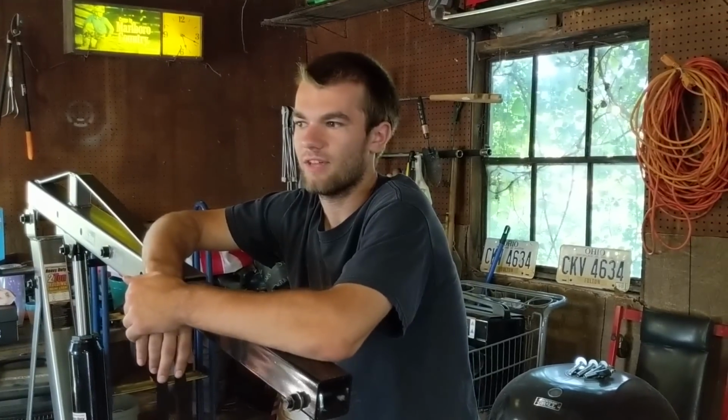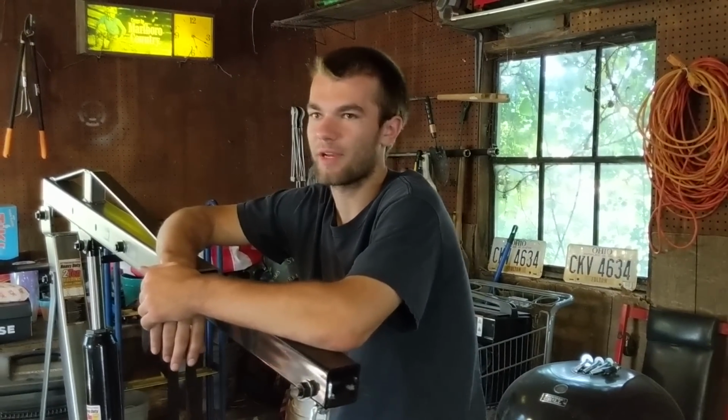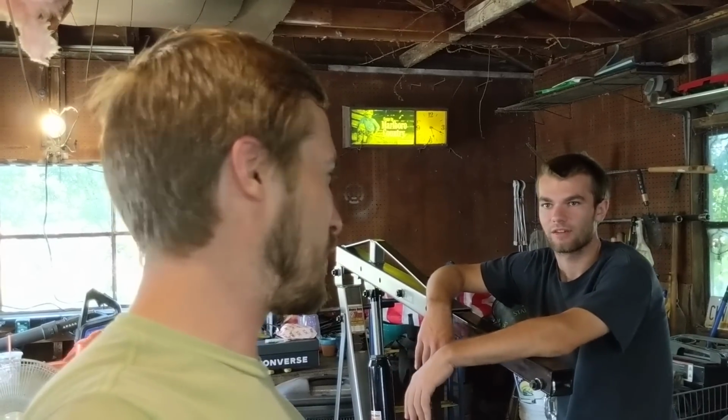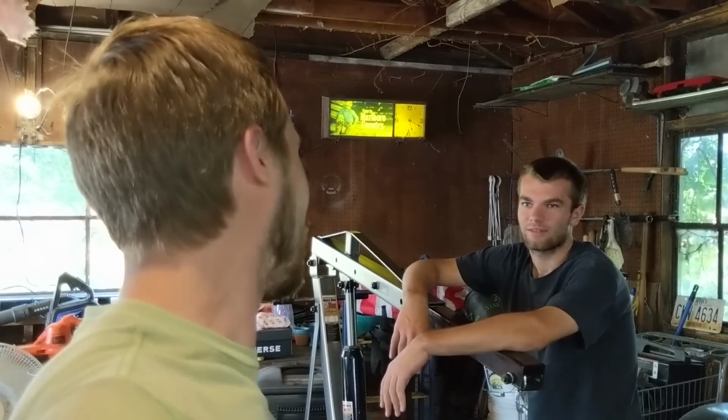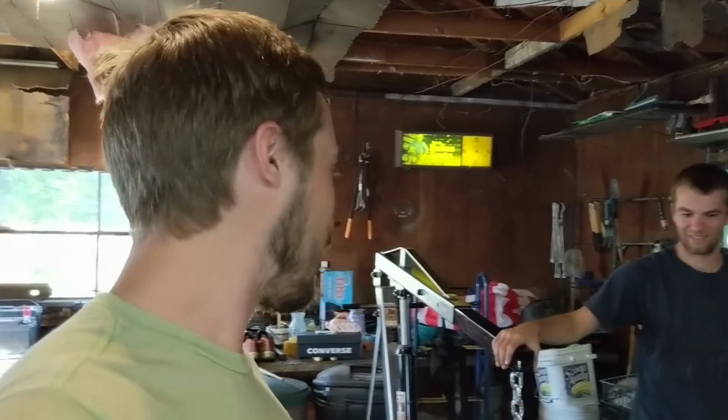Yeah. I think honestly the brake fluid would last longer because it wouldn't absorb moisture as fast, so it might actually be better, because I'm assuming regular jack oil just soaks moisture up like crazy. But viscosity is the only big difference between the two: brake fluid's runny and hydraulic fluid's a little bit thicker and stickier. If you're an engineer, let us know. We could probably go to DOT 5 and use full silicone brake fluid. Anyway, if you actually know, leave a comment. Otherwise, you can leave your opinion and I'll still read it. But we're going to go buy some jack oil because it's cheap anyways.